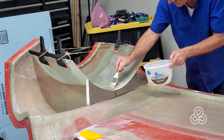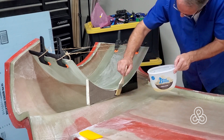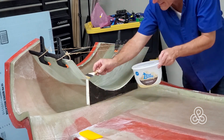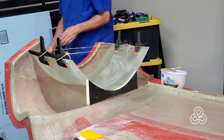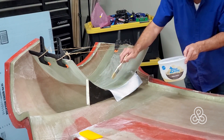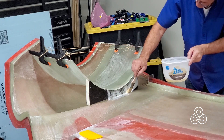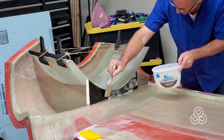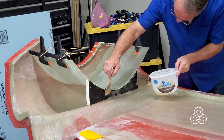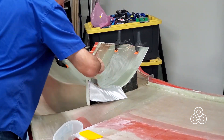There's also a foam piece we put in the front. We're going to lay some cloth across the flat panel, down that foam, and then onto the main part of the clamshell — the same process again. Some short pieces of cloth lapping over, down across the foam, and onto the clamshell. I'll put about two layers of glass cloth here — this is all just to bond things in place.